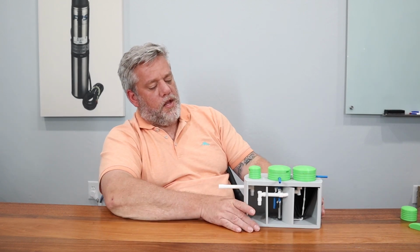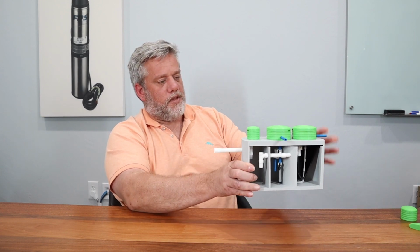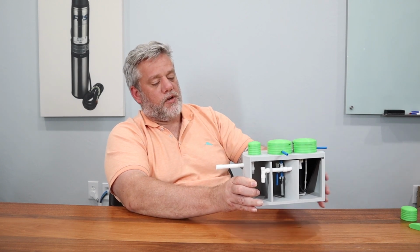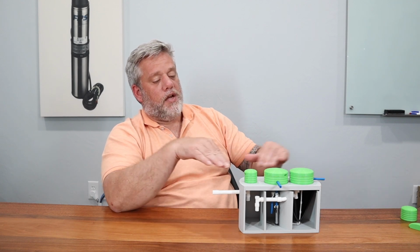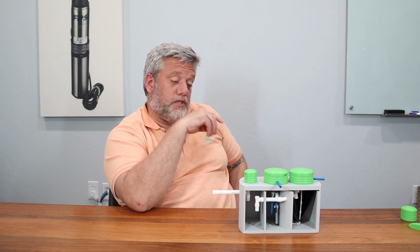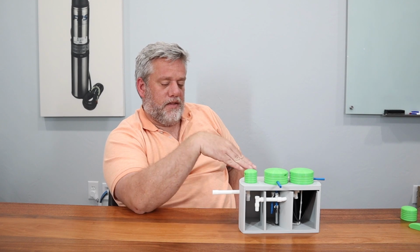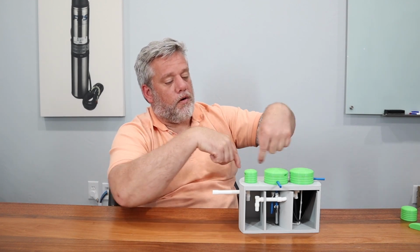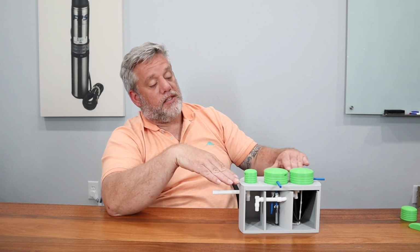Guys dig one hole. They make sure the ground is level. Truck comes out with a big crane, lifts this whole unit up. This pipe's not in there, obviously. These pipes aren't connected. Drops it in the ground. They backfill it, pack it down, and they're done. With some systems, new installers, you'll sometimes see they're afraid of hitting the tank and they won't pack this last part, and I call it a moat because you have a ring of water around it because they didn't pack it all in. You can fill that in, make this level.